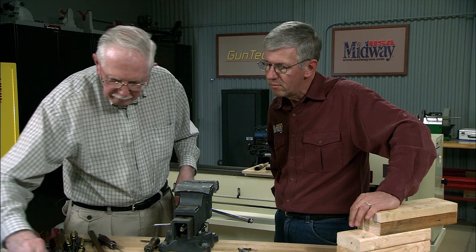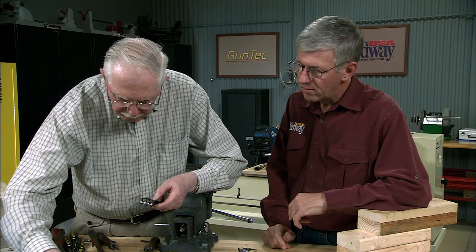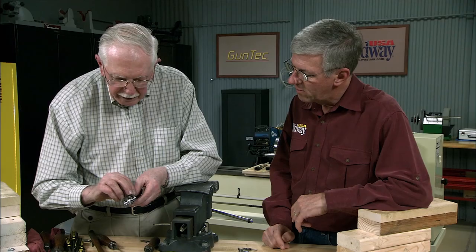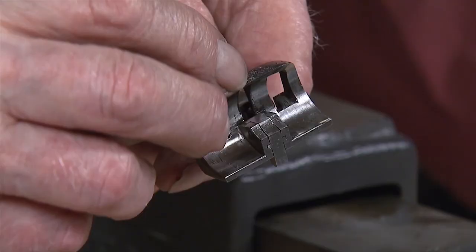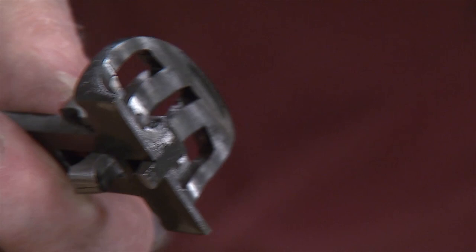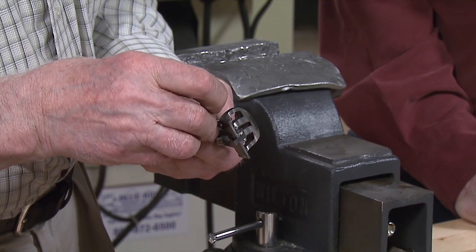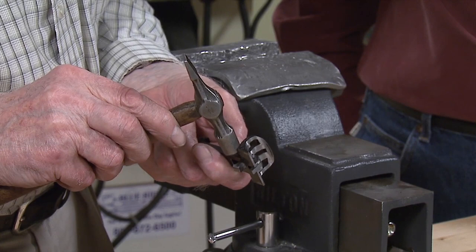Now, we'll go straight onto the fore end. What I do is put in the ejector mechanism, or ejector work, first. Put the two kickers in. You can't put them in the wrong side. They're only going one way. Line up the holes. Put their axis pin in place. They just push in, in most cases.